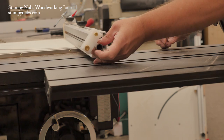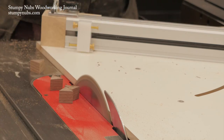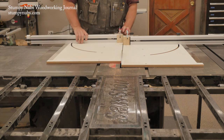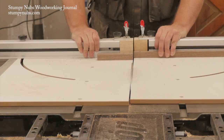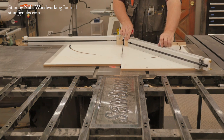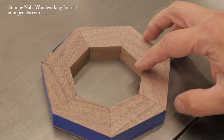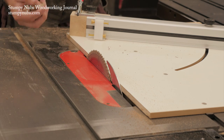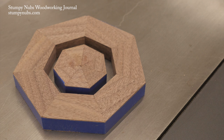If you're making segmented objects you'll need a way to safely hold small work pieces, and the W sled has you covered with its quick release toggle hold down. It also has a micro adjustable stop for repeating cuts on short or long work pieces. When you first assemble it, you trim it to fit your saw so the edge of the panel and the fence become a precise reference point. I recommend a 60 or 80 tooth crosscut blade. For the ultimate setup, I have both a right and left hand version, which supports off cuts and allows angling fences in both directions — handy for profiled stock like complex picture frames or moldings. Jerry prefers to sell directly to control quality and customer service. I'll link to his website below.